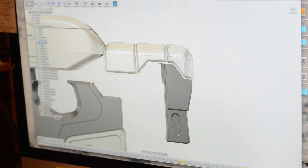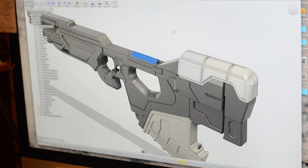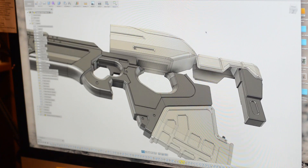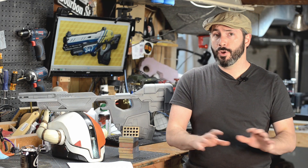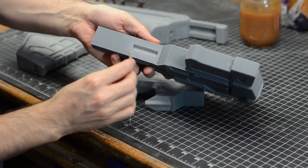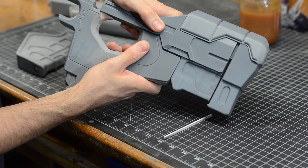I'd like to point out that for some of the connections on these parts, I simply overlapped a couple of pieces and used Boolean operations to cut them out. This way one piece would fit exactly into the other piece. Now you may be saying Bill needs to add some tolerance so there's a little room for those two 3D prints to squeeze into one another. A lot of these parts fit together no problem even though the Boolean was one-to-one with no tolerance added. Any pieces that were a little too snug I just sanded a little bit and then they fit together no problem.